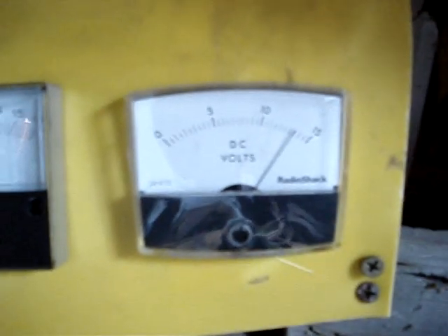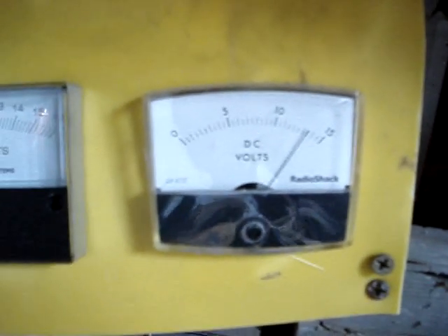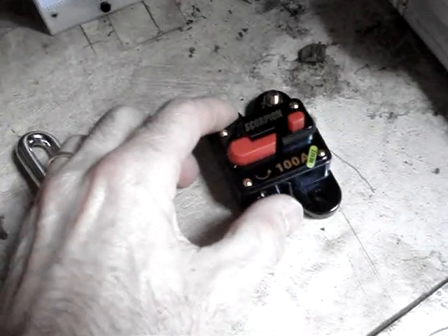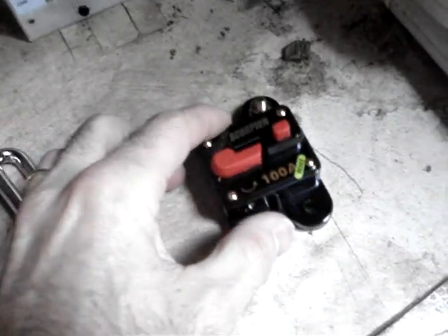The batteries are down there, of course. Everybody's seeing the batteries. A lot of people are buying batteries for power outages. I've got a little bit of amps coming in because the sun's gone behind those trees over there, but the problem is I don't have much of a sunny spot. Anyhow, the next route is to install that circuit breaker — which I really needed — so I can do the shutoff from the panels to the charge controller.